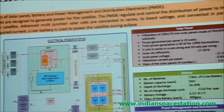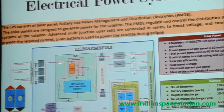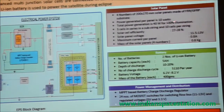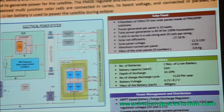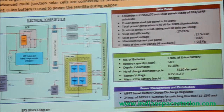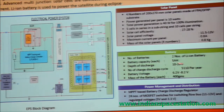These give details of the subsystems — the electrical power system includes two solar panels, a battery charger, and discharge regulators. The solar panel can generate almost 40 watts with 100% illumination. There are two batteries in a two-bus configuration, each with around 5 Ah capacity. The total depth of discharge will be less than 10% to meet the cycle life requirement for a two-year satellite life. We have power management with around 24 switches to switch on or off any of the subsystems onboard.